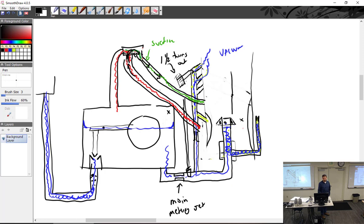And so what you're going to do is put this carburetor on the ground power unit, run the ground power unit, and adjust the idle speed and idle mixture because you can. You're sitting right there with the carburetor, there's no propeller, and it's a little noisy. But